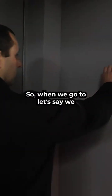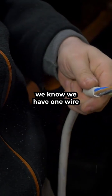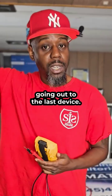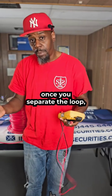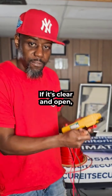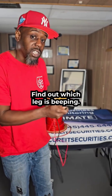Let's say you pick a pull station and you separate the wires. Now you have one set of wires coming from the panel and a set going out to the last device. Once you separate the loop — especially with the wire off the main circuit — you test both wires. If it's clear and open, then you test one leg to ground, then the other leg to ground, and find out which leg is beeping.